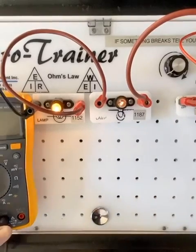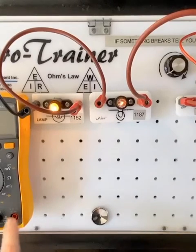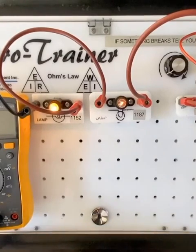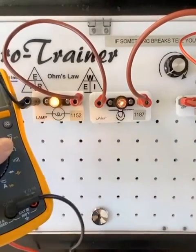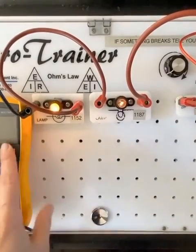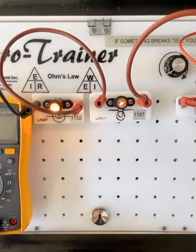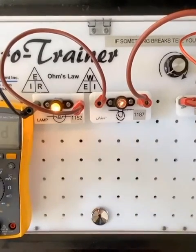When doing amperage testing, as soon as I'm done I turn off the meter and pull the red lead — it keeps me from accidentally leaving it there for another test. If you're going to accidentally leave a lead in a hole, leave it in the voltage hole. Down here the meter says '10 amps fused,' so if I'm running a circuit with more than 10 amps, this meter won't work — we'll need an amp clamp. Now we're in the amp hole and we'll go ahead and set the meter to DC amps.